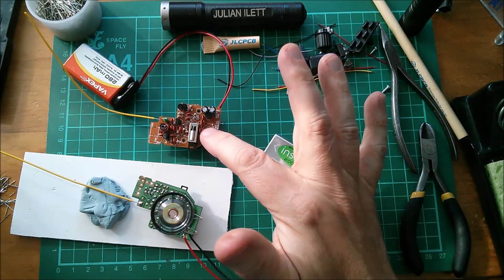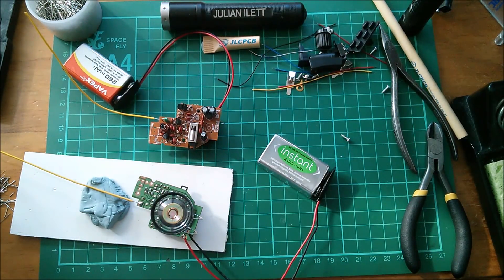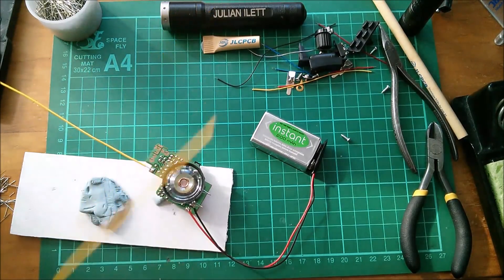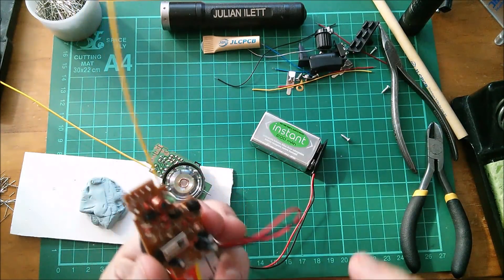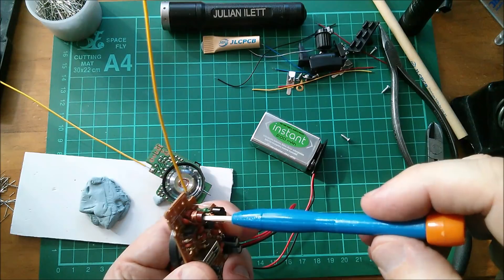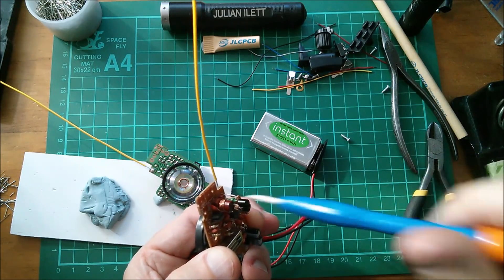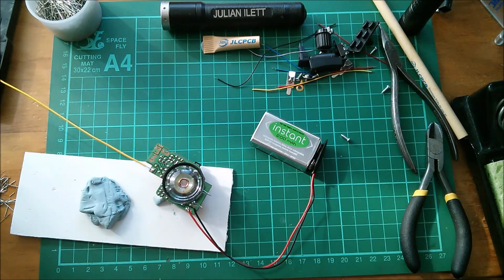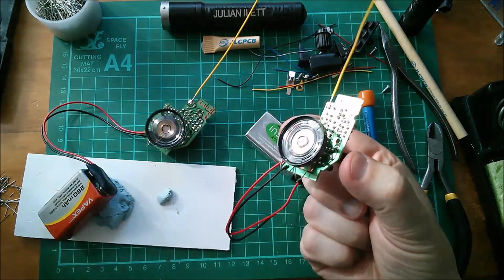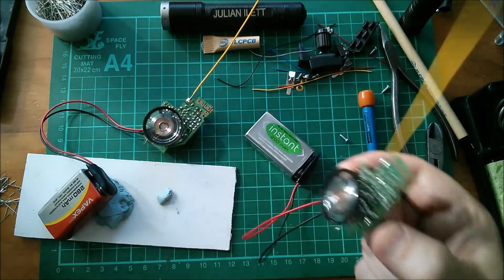So I think the only thing I can do to tune them is to turn the little ferrite inside the inductor there a little bit — got to be careful because they're very fragile and they break easily. They interfere with each other quite nicely. I've bent my antenna, but what I want to do is tune it, so I'm going to twiddle with this ceramic screwdriver on the little inductor there. It seems quite loose. That goes off, twiddle it back, that goes off — so somewhere in the middle. Hello? Hello? Hello — and then there's... will they feed back? Well they certainly do.